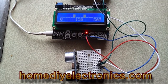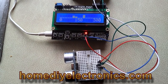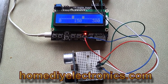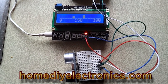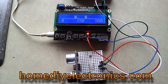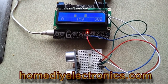The ultrasonic sensor is a very simple one. All it does is send out a 40 kilohertz burst of pulses and measures the time it takes for the echo to come back to the sensor. So it can only measure one echo at a time, and depending on which one is the dominant echo, sometimes it picks the first one, sometimes it picks the second one.